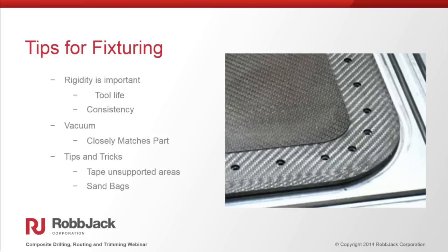The most common fixturing is vacuum, and if that vacuum fixture can match the part as closely as possible, it will really enhance rigidity. Many companies spend a lot of time maximizing fixture rigidity at the beginning of a run, and it pays huge dividends in repeatability, quality, speeds, feeds, and consistency. Sometimes you can't always have a vacuum fixture — if it's a short run or non-production environment, you don't always need the high-cost solution. Something as simple as sandbags on a non-rigid area of the part can dampen vibration.